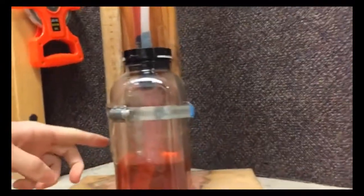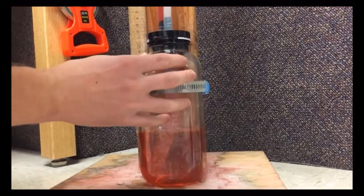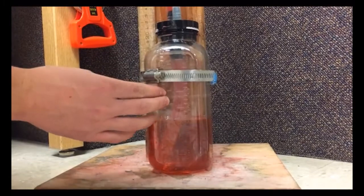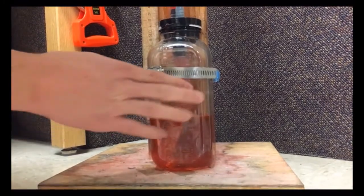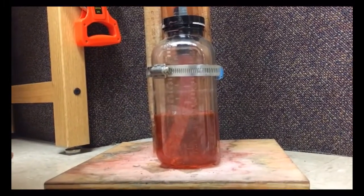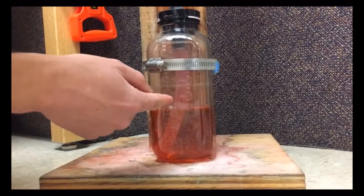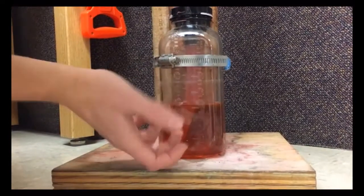In case you get stuck, here at the end, I'm gonna go through a couple hints that may help you on going through the lab sheet. Okay, so the key to this lab is to understand what is happening inside the tube at the surface of the liquid here. And so if we think about it, the pressure inside the air, right, is what we're measuring on the gauge. The absolute pressure inside this jar where the air is, is the gauge pressure plus the atmospheric pressure. And that pressure, we can relate it to the pressure at the surface level inside the tube. And so maybe think about what would happen if the pressure inside the tube at the surface was maybe greater or less than the pressure in the air cavity, and how the fluids would adjust.